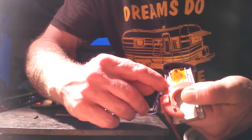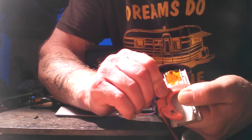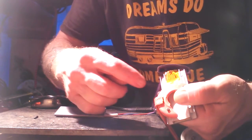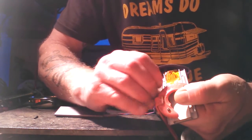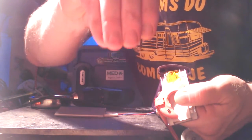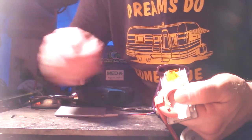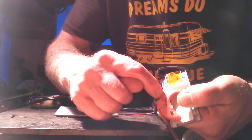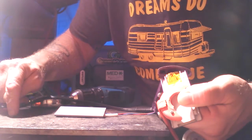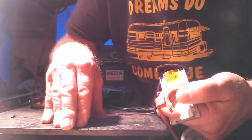Right here what I did was a pilot hole lined up with this one, and a pilot hole lined up with this one for my next 2 holes. Now this doesn't have to be laser perfection, but it does have to be fairly accurate. These screws are long enough that, say if this was going into the unit straight, if I had to turn it on a bit of an angle to catch my aluminum, this is the steel part, if I end up making a mistake going at a bit of an angle, I'll still be able to get it.